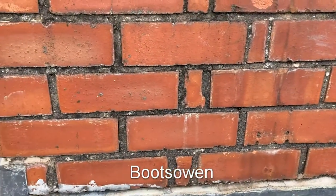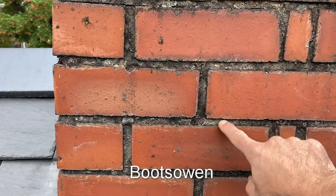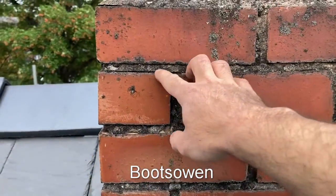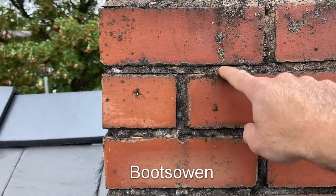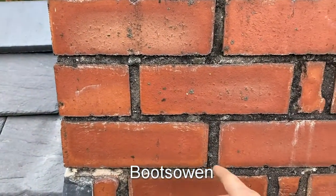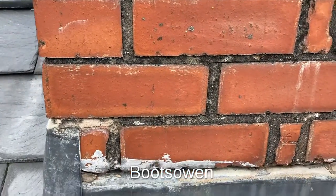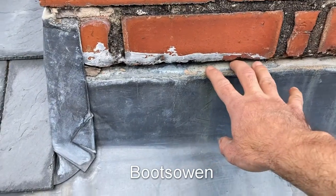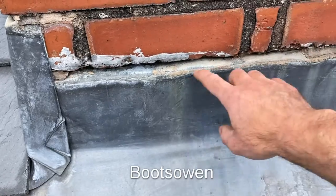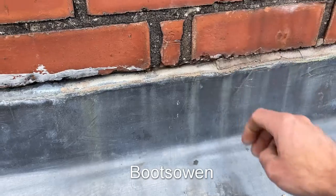This is built out of engineering brick - that's modern, I'd say 20 or 30 years old. I thought this pointing was bad but that pointing is fine generally. Some of it's a bit loose but it's not completely loose, some of it has gaps but that's not such a big issue. The lead flashing was new when the roof was new, five or six years ago, and you can see that pointing's come out there - it would come out if I gave it a bit of attention.